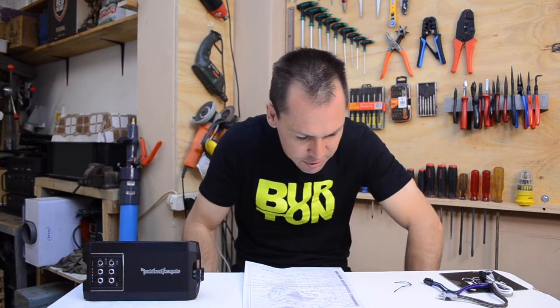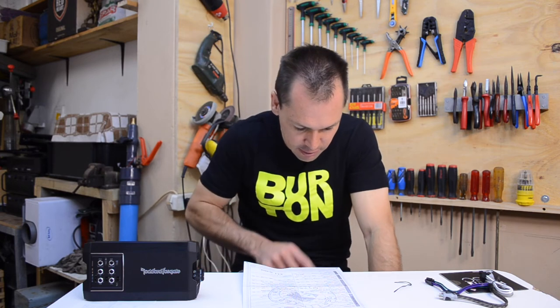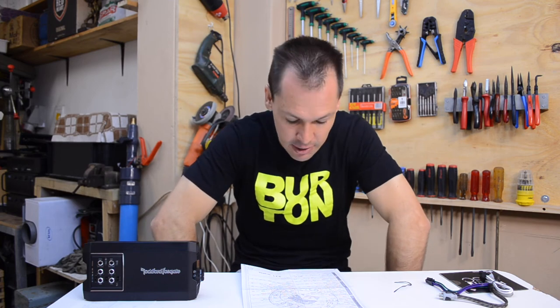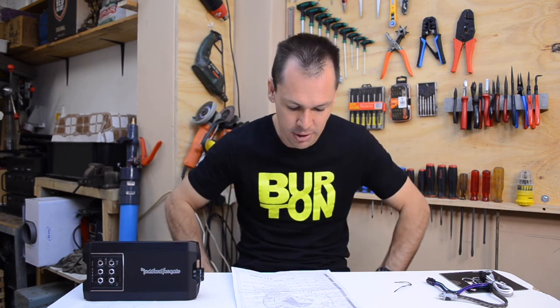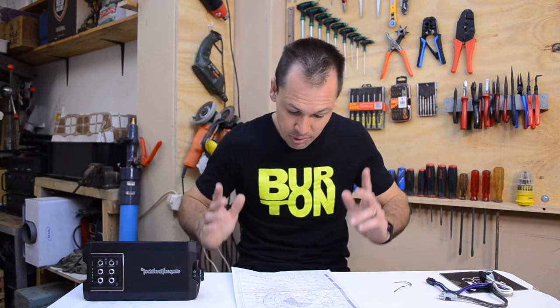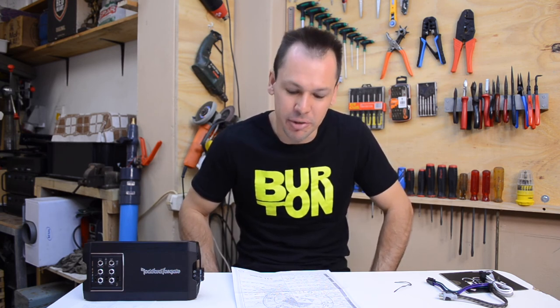Not too impressed with the unscreened section. The amplifier is tested from 20 Hz to 20 kHz. One thing worth mentioning — and this is pretty much standard for most car amplifiers — all the power and RMS watt ratings are tested at 1% total harmonic distortion. That's quite high. In studio gear, amplifiers are typically rated at a constant output at 0.01% THD. It's a bit of a difference, though it probably doesn't matter much in car audio.